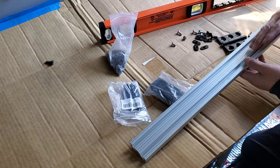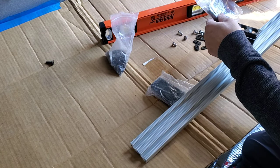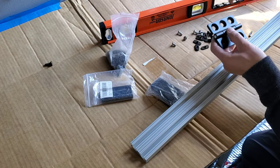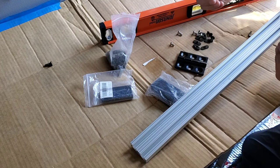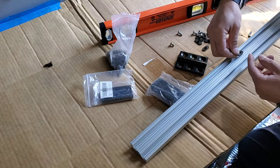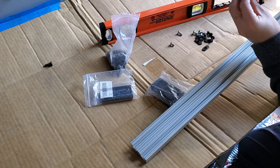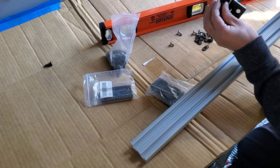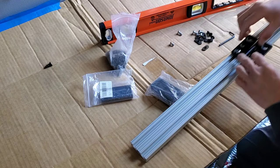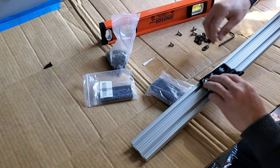I plan to attach the bed frame to here using this, it's really thick. I forgot how thick it was. It doesn't tell. It's a 3-inch, but it's super strong, designed for aluminum extrusion like this. Okay, and I'm gonna use these stainless steel bolts. They're very short, and then with this inserted nut inside the channel, like so. Okay, tight to that. Just insert one for now. There, the nut and then this bolt tightened to it.